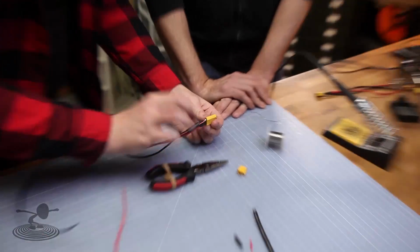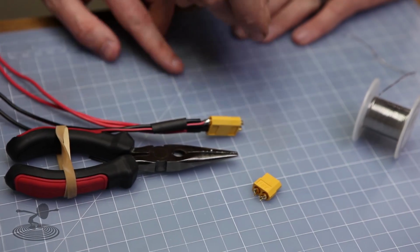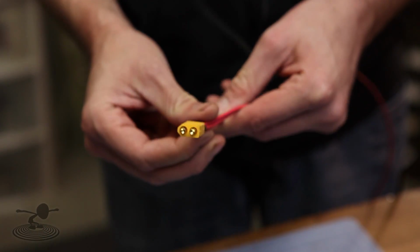Yeah, it's bad because you can create a bubble on the top instead of properly getting everything pre-tinned. So you get a solid flowed out joint, there's solder everywhere, filling it up, creating a proper bond. Because you could do a solder joint that looks like this, but it's only on the surface covering it. That would be really, really bad when you pump current through it.